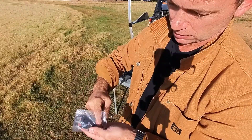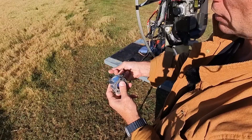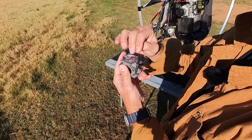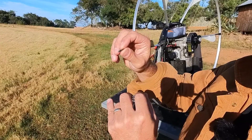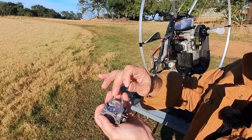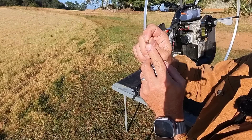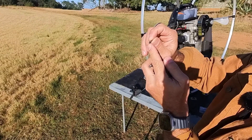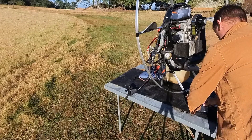Let me show you guys this other part that's very important. On the carburetor second stage, this pin has to go in there. I'm not going to show the full assembly because when you open your carburetor you'll see all of this anyway. What I need to point out is that although it looks entirely metal, it's not — there is a silicone tip right at the front. Most guys servicing this, because it looks like such a complex little thing with a spring, sometimes neglect to replace this. You have to replace it because it gets an indentation ring as it pushes onto that valve, and that indentation causes problems. Replace this whenever you do a carburetor kit service.